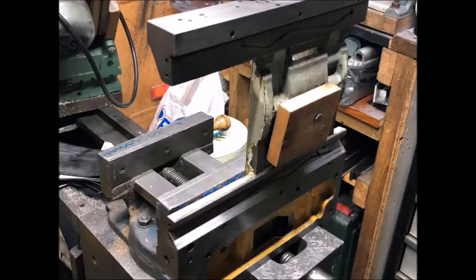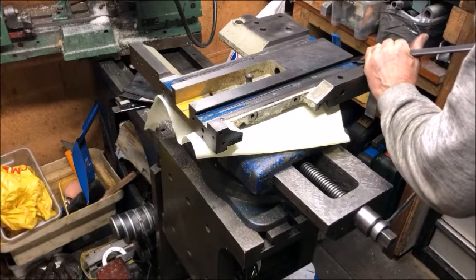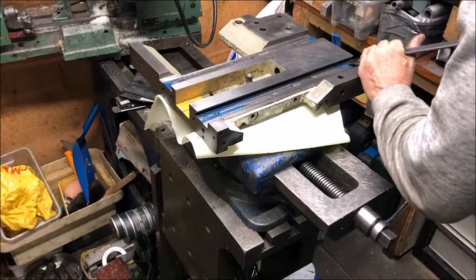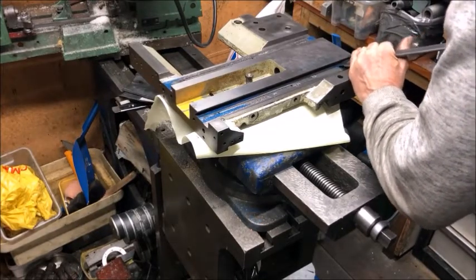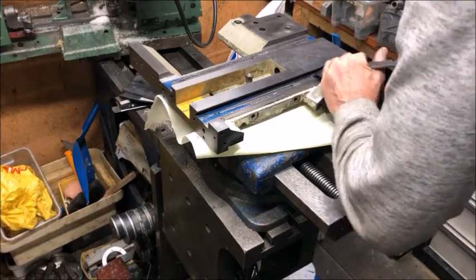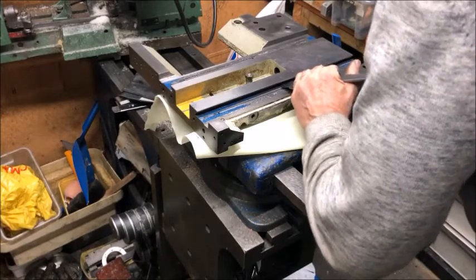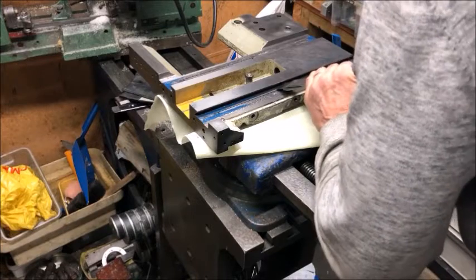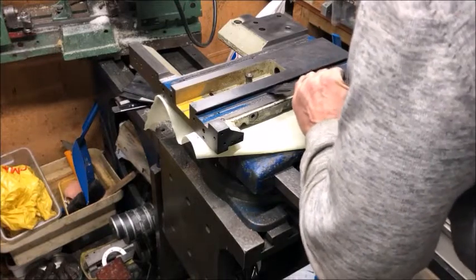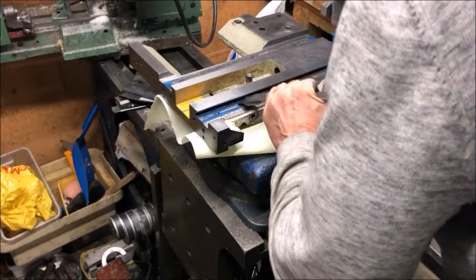Now the time has come to scrape the saddle. I've used just a block of wood to mount it to the vice, as you can see. It didn't function all that well — it's a little bit loose. However, scraping here, I just make some passes on the inside to the crest of the dovetail there, because there is a tendency to scrape less there. So you have to really make an effort to do that.